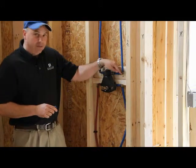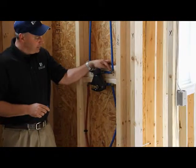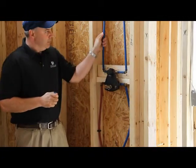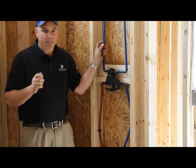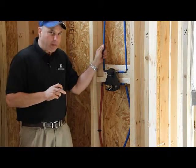We use these brass fittings where they come to a junction or an elbow, with high-tensile steel compression rings to make sure it's a tight seal. This is very, very strong pipe. It's not the butylene pipe that had all the lawsuits about 15 years ago where stuff was breaking and leaking in people's homes. This is a completely different product.